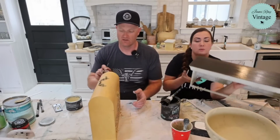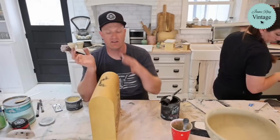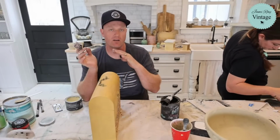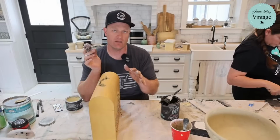Zeb, what's the difference between dry time and cure time? That's a good question. Dry time is just the amount of time it takes for the paint to dry so that you can touch it. Cure time on most paints, industry standard, it doesn't matter what kind, what brand, is about 30 days for most paints.